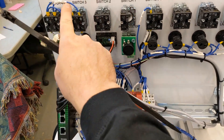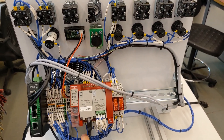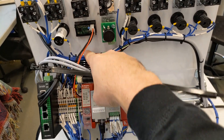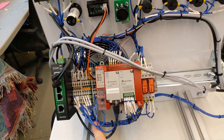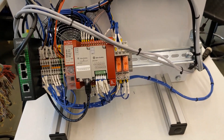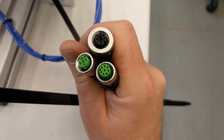On the trainer, we have made a wiring harness just for the Limbo Dance demo. I'm going to urge you when you're not using it to remove it and have the students learn to wire the configurable safety relay. This blue harness that you see tie-wrapped throughout here actually comes down and continues around to the drive. If you unscrew everything, it'll neatly peel off. It also includes three cables, and here is where you make the connections to the light curtain and the safety mat.